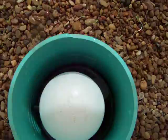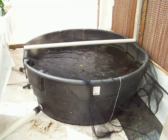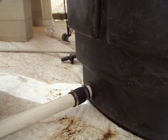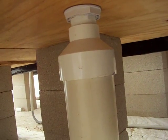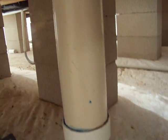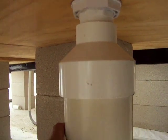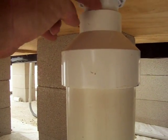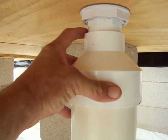It's kind of a guide. Over here you've got your 300-gallon tank, with your drain from your siphon through to the sidewall. This is not glued so that air can escape right here — without that the siphon will not work. Do not glue this.